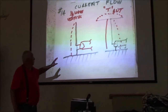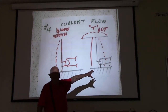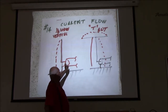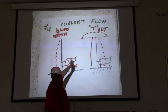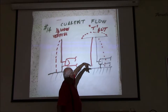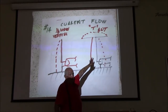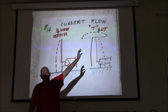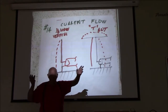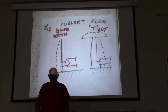But what he ended up with was, in the case of the Titanic, they had two masts on the Titanic that were almost on opposite ends with a wire stretched between them, and a vertical running up to them that was about 100 feet high or so, 200 feet. And it was transmitting on about 200 or 300 kilocycles, clear down in VLF. So all the radio moved down into VLF because they needed big antennas to get from A to B.